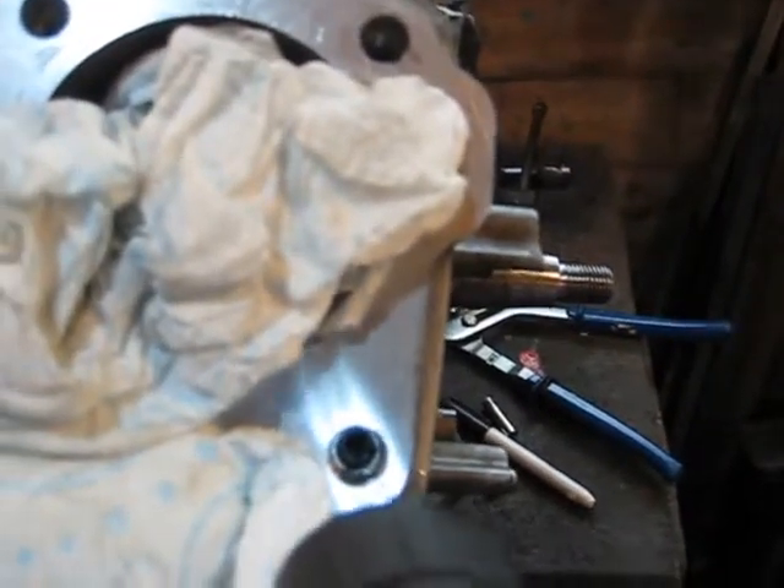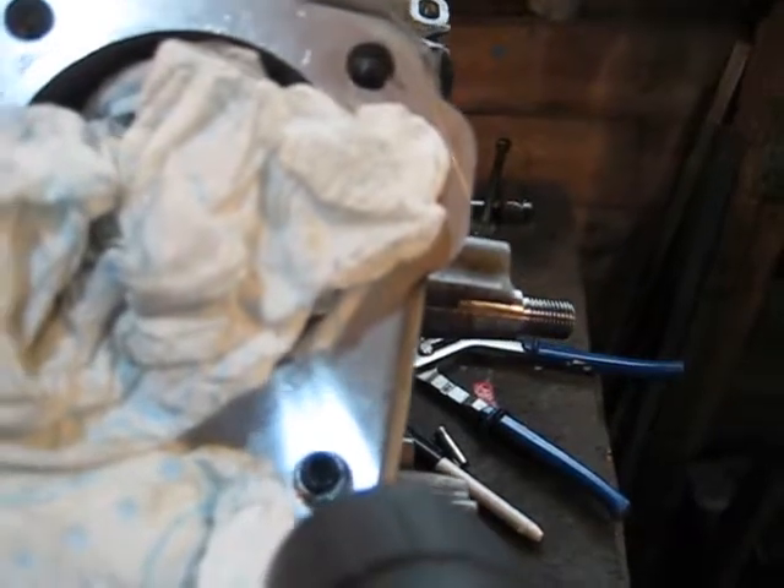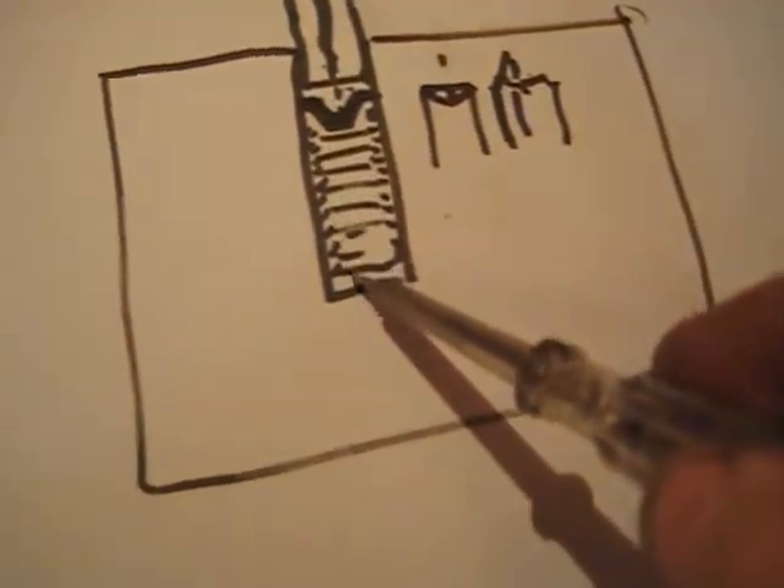Right, I've got the small drill in there now. You can see where the drill is going in - I can't be far off being right through to the bottom. It'd be better if I can go right through it. Right, I've drilled through - I've got the hole slightly off centre. I've broken through with the drill, I've got the full length of the stud - I've got a hole drilled right down the centre of that stud and broken out at the bottom.